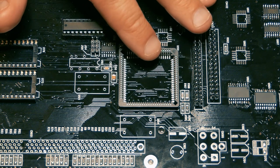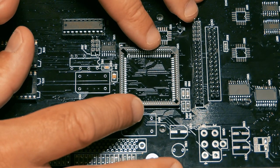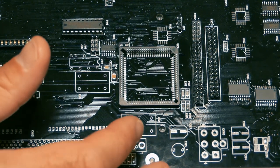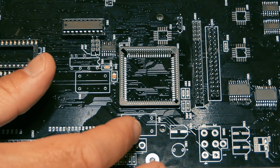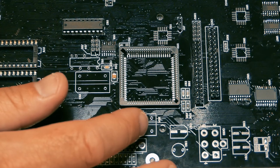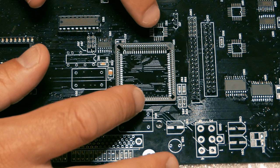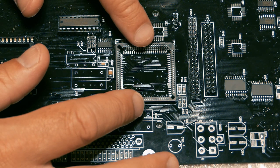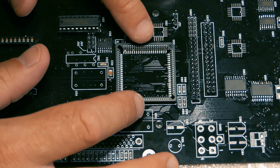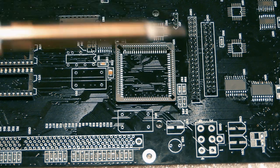Okay, so this is a PLCC socket that I was talking about. I'm a bit afraid now. It has a pin that goes into a locking hole, so you won't put it in the wrong direction. Another way to do this is to skip the socket. That's actually the easiest way, just put this chip on the motherboard and solder it directly. That's more easy. But we want sockets because we need to replace these chips, or maybe we need to borrow them to check a dead A4000 that we're probably gonna buy next year.